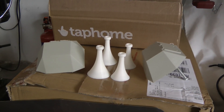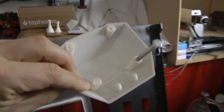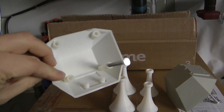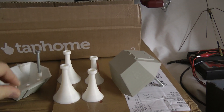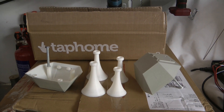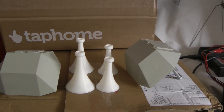For some of the smaller parts I started 3D printing. This is going to be a sandbox, which will go on the side of the bogie to store sand. I printed them hollow because the plan is to fill them with resin to give them enough weight and resistance against rocks or anything that might damage them. I have two of these, and the resin should be arriving today. I should be prepared for some shrinkage, but these aren't dimensionally critical so that's fine.